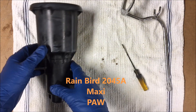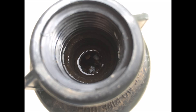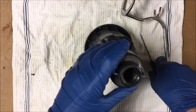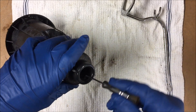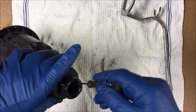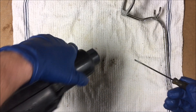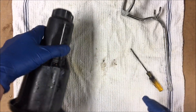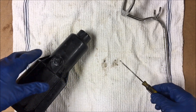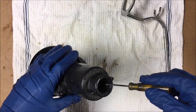What we've got — and I don't think you're going to be able to see it — but down inside here is the initial filter, which is just a screen. It's got some grass and stuff, looks like some plastic. There's no telling what all we're going to dig out of there, but it doesn't belong in there. It's causing a little obstruction and I've got to get it out. This Cajun Air system claims that the water that comes out of that last tank and sprays out of these heads is 99% pure, so all we're dealing with is the 1% that ain't pure.